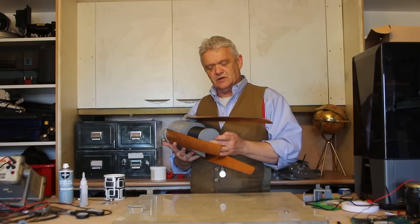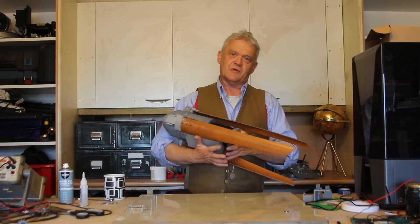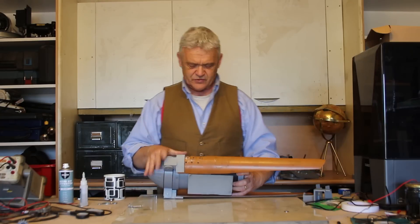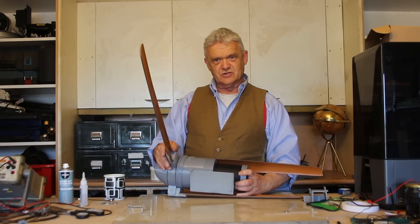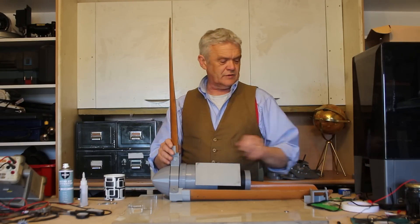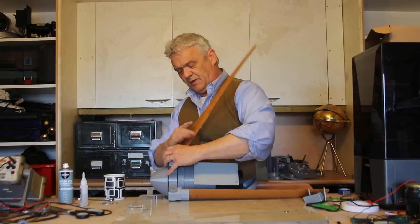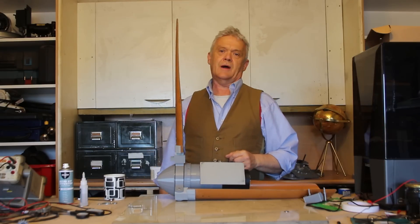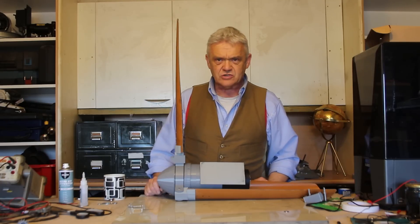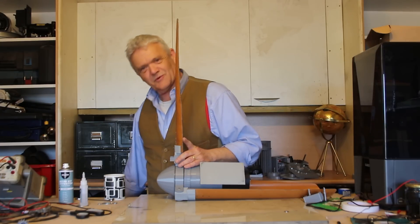For a natural wind turbine we need to put a pole coming out of the back here with a fin on it so that it tracks wind direction. But that is the folding wind turbine pretty much finished. Now there is one other issue I want to discuss — the blades. The blades obviously fold out but they're going to collapse back in unless we do something. The solution I've come up with is clips — you just put a couple of clips on there, they snap into place and hold it out. I think a better solution is required, something like a retaining pin, but I'm going to use these clips because it's expedient and quick — I want to get this thing tested.